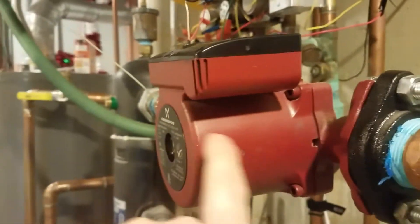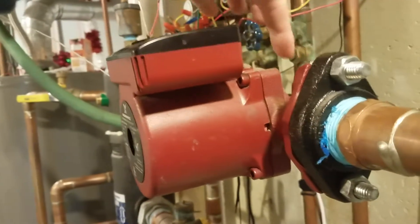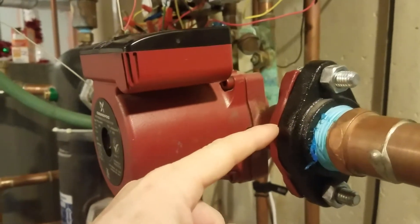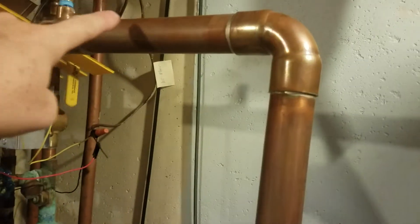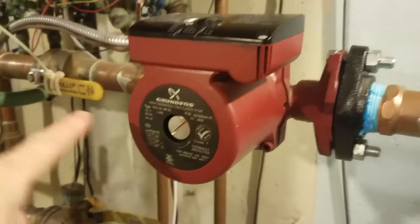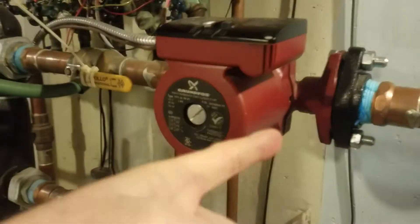You can take this portion completely off of the flange portion back here, and this thankfully has a check valve in it. I've got a shut off over on this side so these isolate, thankfully, because whoever put this system in didn't put a shut off over here. I found a lot of things that people that put this system in didn't do right — such as this pump isn't supposed to be mounted this way. These really are supposed to be vertical mounts.